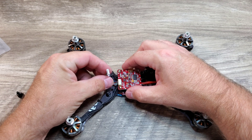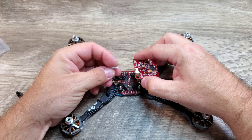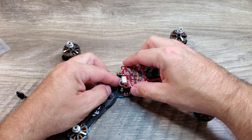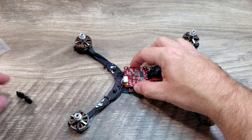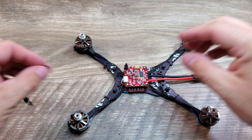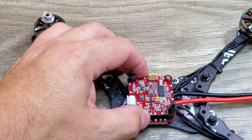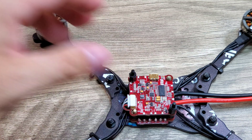We're going to go ahead and plug in the cable here to the flight controller. I just like to give these wires a little twist — keeps them a little bit more neat looking in the build. Plug in our connector like so, make sure it's pushed all the way in for a nice good connection. I'm going to tuck this excess wire underneath of the flight controller, and then we're going to go ahead and put the flight controller on the stack. I'll take these plastic standoffs and tighten these down. Notice how the board has a little bit of movement — that's the vibration isolation from the soft mounting that's going to keep unwanted vibrations out of the gyro to give you better flight performance.